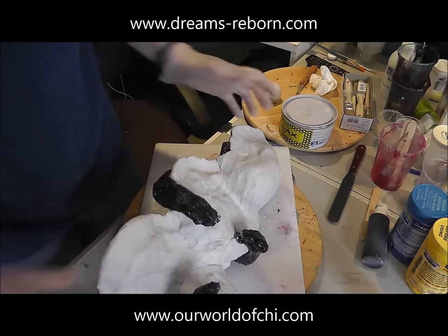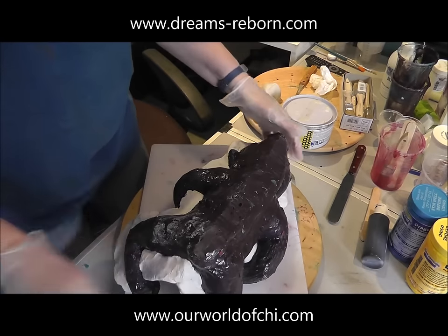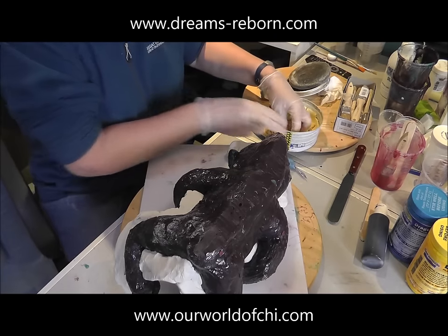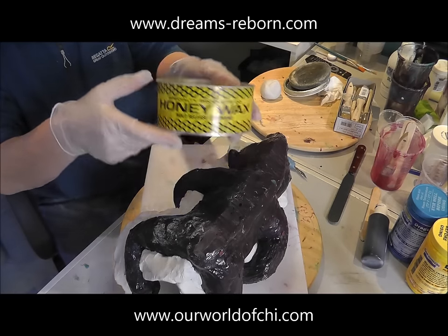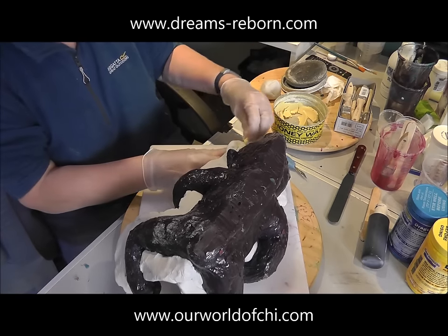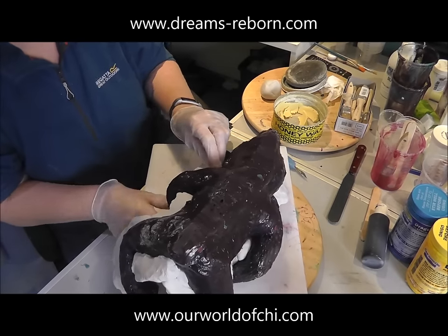So we're ready to do the next side, and I have actually remembered that I need to use the mould release. You really have to remember that, because you really stuff up if you don't use it. Now, I use wax, I just use honey wax, but it's gone all dry, so whereas I used to apply it with a brush, I can't now, but it still works just as well, so I'm just going to rub it on the